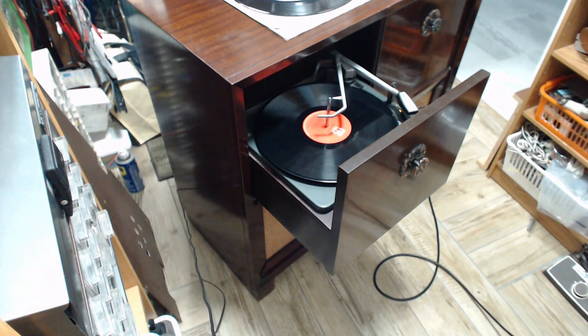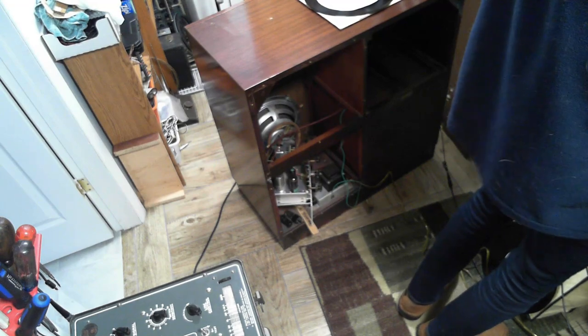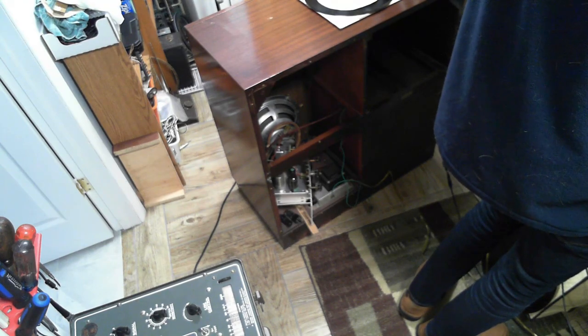Now there's one more too. That's a 6SC7, I believe. That's the preamp for the cartridge, which tested kind of towards the end of its life. It's a two-part tube too. One half tested kind of towards the end of its life, and the other half tested weak. So why don't we try? I've got one here. Well, let's give it a try.